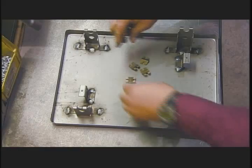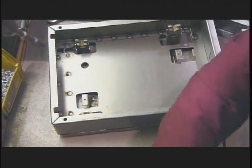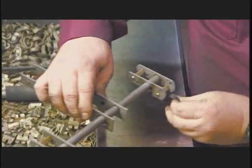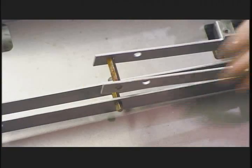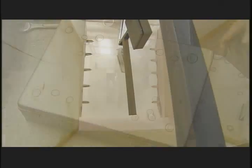Workers place steel bearings at each corner of the base where the lever mechanism will rest, then add the base frame. Next, they install the long lever, then the short lever, and a C-clip joins them together. Once right side up, the lever mechanism hangs off the platform.